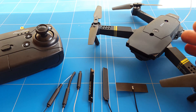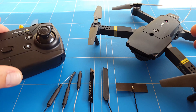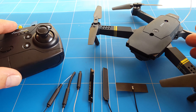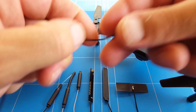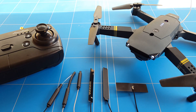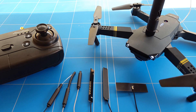I thought it was going to be a really easy modification to get the Wi-Fi FPV range to improve by a whole bunch — just a simple modification like we did to the transmitter. I was adding an SMA connector extension lead to the Wi-Fi FPV module, which luckily comes with an IPEX connector, so we don't even have to solder — it's just plug and play — and then having the dipole antenna sticking on top of the drone.